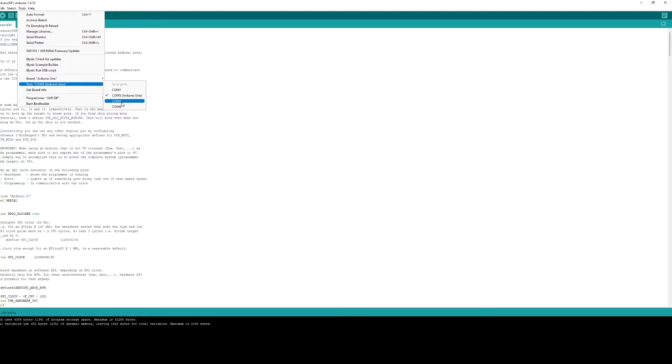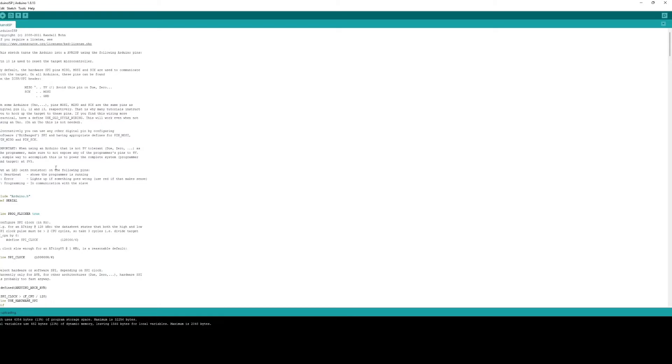The key for me was that when I tried to plug the keyboard into USB I got an unrecognized USB device and didn't know how to talk to it with AVR dude. Using the Arduino Uno on a COM port — no big deal. The programmer is AVR ISP. Then I burned the Arduino ISP sketch onto the Arduino Uno — I'll just burn it again here; compiling sketch, it's already done — and now I'm able to use the AVR dude command-line interface.